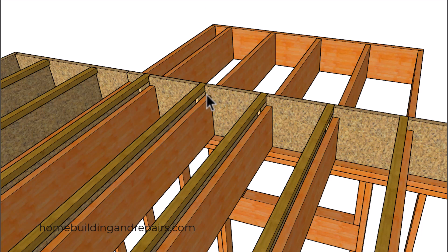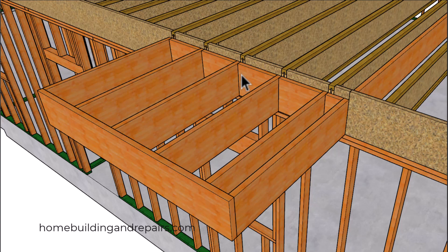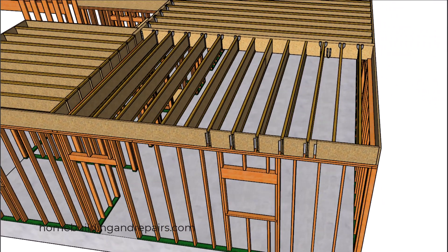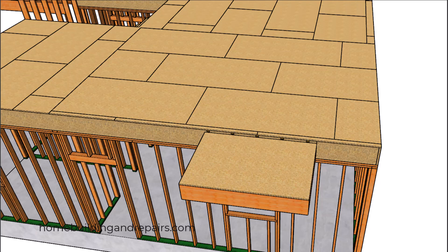I went ahead and notched the rim boards over the deck joist, and you can see where we have our web stiffeners. The exterior deck is going to be two and a half inches lower than the floor framing, so we are going to have some blocking on the outside. These blocks might not be required if you're going to use decking materials instead of floor sheathing. Let's remove the decking joist, give you an idea of what it might look like, and then reinstall it with our blocking. We're going to install the floor sheathing for the deck also, which means it's going to need to be waterproofed. I have about 12 feet two and a half inches, which means I'm going to have to cut a small strip at the end — the engineer might not like that. Check to see if you can move the beam forward a little bit so you could use four full sheets of floor sheathing instead of cutting a small strip.